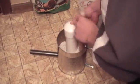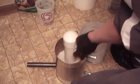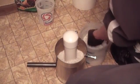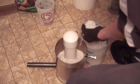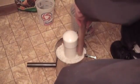Here I've added the perlite and I mix until I get a consistency of wet sand. Then you just plop it into the bottom. Here you can see it all rammed down into the bottom. I prepare another batch for the walls. With the center form and the burner form in place I ram up the sides. Each layer is a small batch because with the addition of the plaster this stuff sets up fairly quickly.